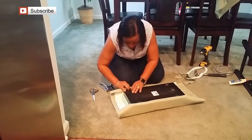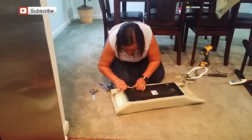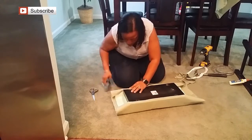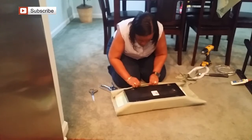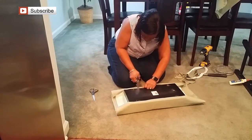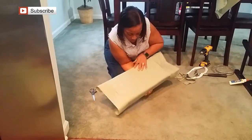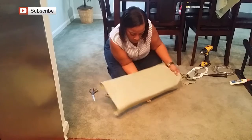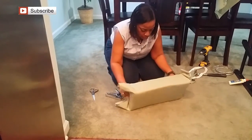We'll fold it over and prepare to staple. It may look a little short, but here's where you want to pull it taut so you don't have a whole lot of excess fabric, and when you flip it over it'll be a nice smooth finish. So we're just going to pull it tight and staple it down like we did the others. Now we have it at the beginning stages — it looks good, and we're ready to work on the sides.